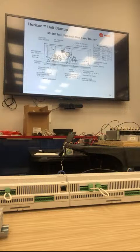No. So that's not a diagnosis. As far as why the flame failed, I don't think that's something we can necessarily pull back. There's no information to know that. Just like what he just said, if all the units come on, the gas pressure drops, or if the gas supply from the supplier drops down to close to nothing. I had that happen, I've only got 2 units on the road. Or the wind blowing it out. I think there's no way for us to pull back whether the flame has been the reason why.